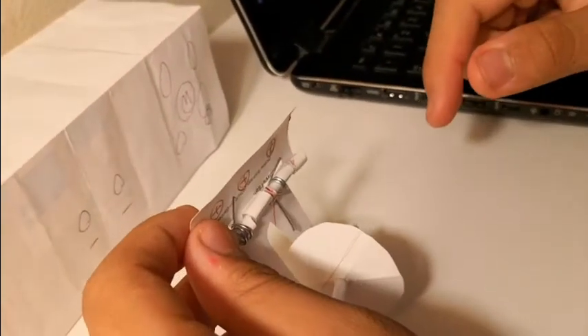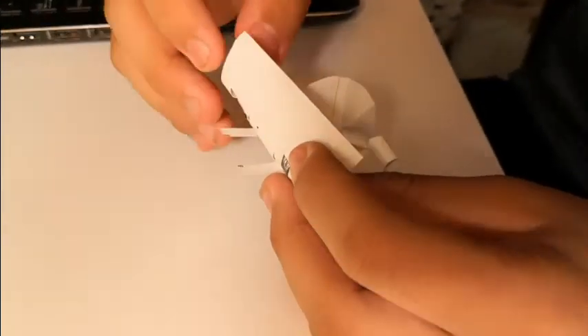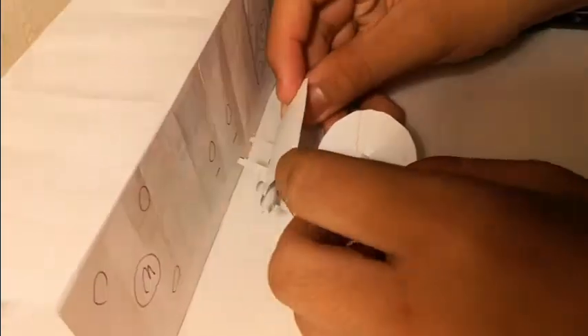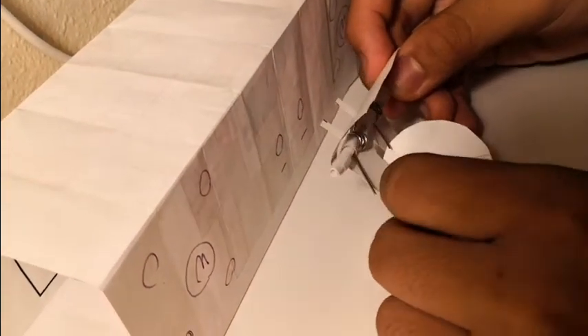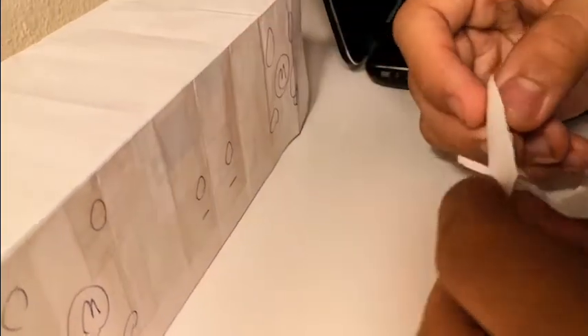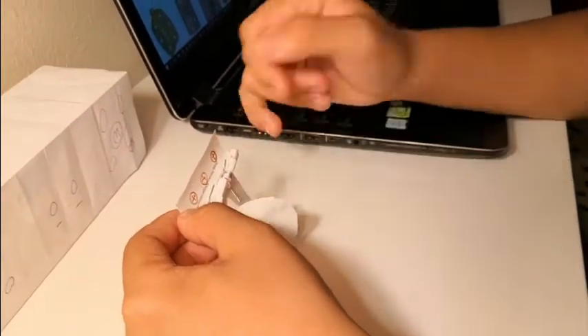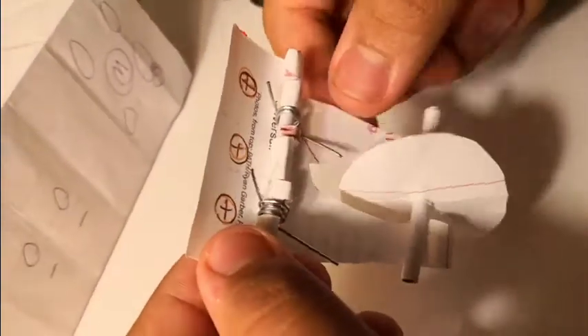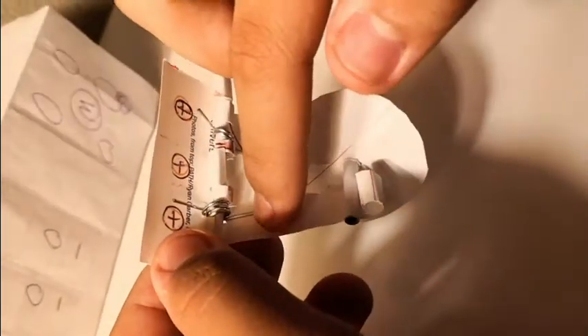Now, hinges rotate 360 degrees. So we are adding two stubs at the back, which will be inserted into holes on the side panel as well. This way, it makes it only able to move upwards, but not downwards. Now these springs ideally will have a shorter end and a longer end — this way it makes this arm much more stable as it takes up more area.